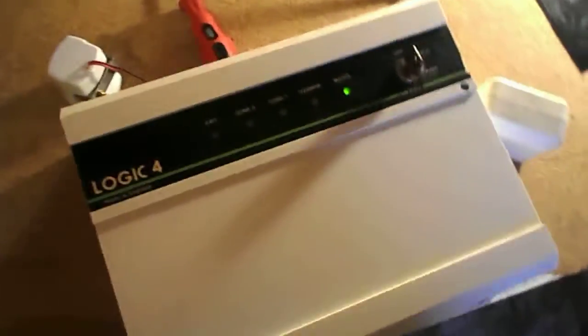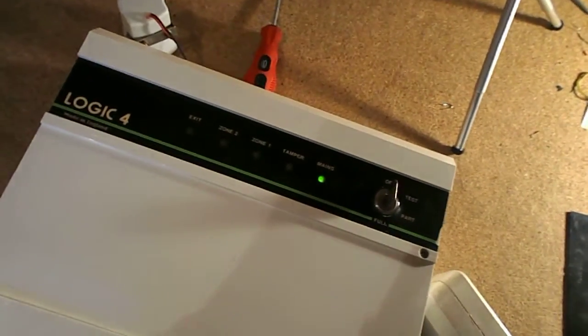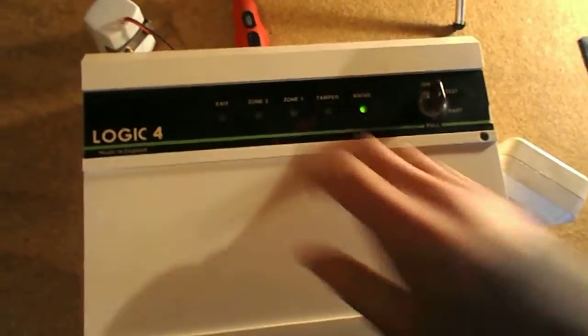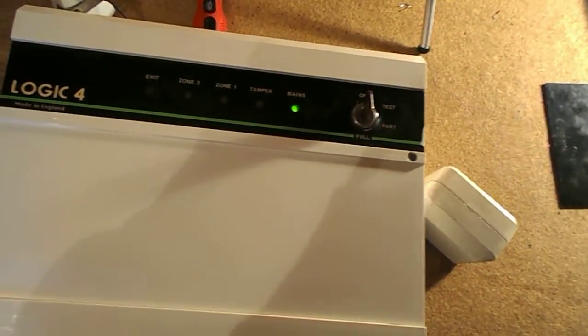So I'm just going to be doing a little test. I've got the PIR, that's a previous video on my channel. Got this PIR going now. Yeah, there we go. It's hard to see because of the light, but there's the LED. So that's in the exit terminals, in the delay zone, or the time zone as it's called in here, because I don't have any door contacts spare at the minute because I've been busy with installations lately, so they're all installed in houses.